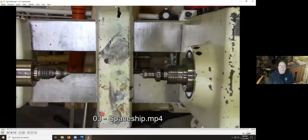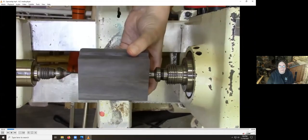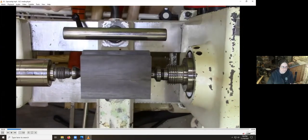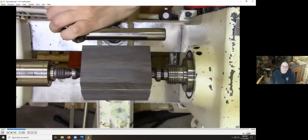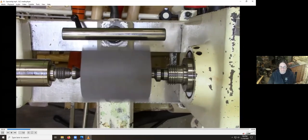Now onto the turning process. I've drilled a half-inch diameter hole with a Forstner bit at the end, about a quarter of an inch deep, and I'm using a step center as a drive center and just a cone point in my one-way center with an eighth-inch hole about a quarter inch deep to locate. It keeps the tail center in particular from drifting if my centers aren't quite lined up properly.